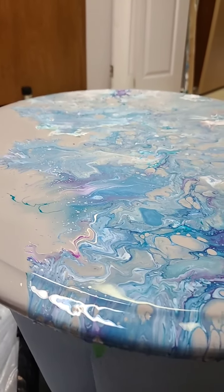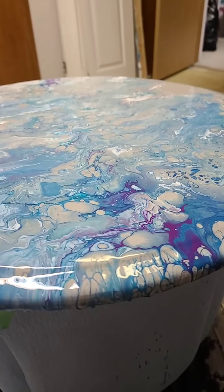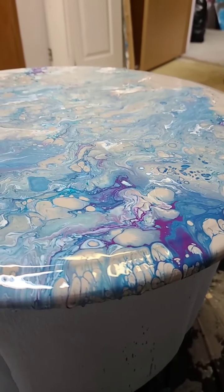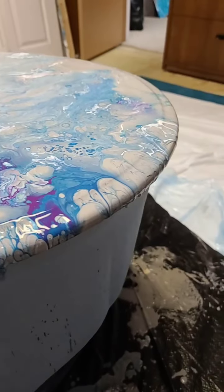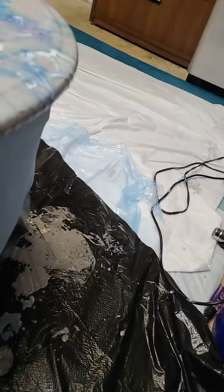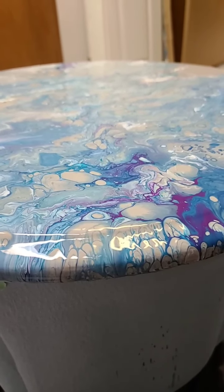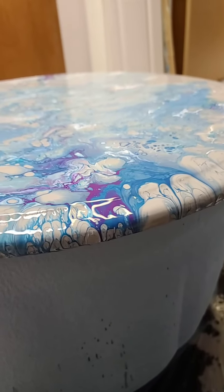As I build these, I put different layers on them, and then I do an epoxy resin top coat. It gives it a really nice glass-like finish. And the epoxy resin that I use is a food safe resin. So it's most commonly used on bar tabletops. So it's really, really nice and durable, can be washed and stands up for years.